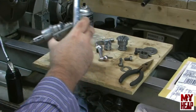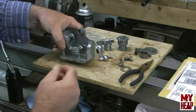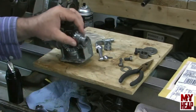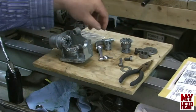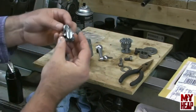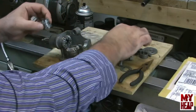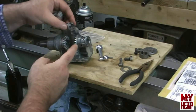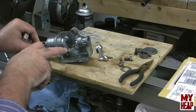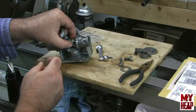So at this point those are together. Remember the other bevel gear goes onto the lead screw — it just sits in here, and we're not going to install it because we don't need that right away. Now let's talk about this detent fork. This fork holds the spider gear and shifts it left and right. Remember, this is what actually drives the lead screw. The direction it spins depends on which of these two bevel gears it's engaged with — if engaged with this bevel gear it'll turn one way; if engaged with the other, it will turn the other way. That's the direction switch. And of course there's a neutral position right in the middle where it's not driven either.